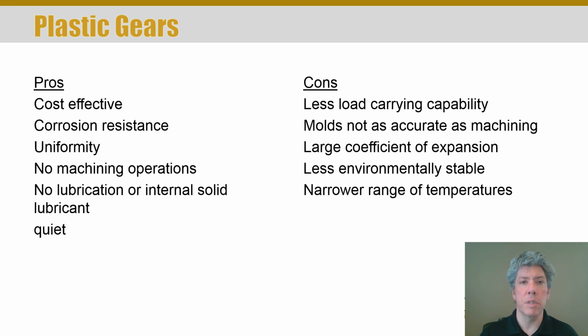It's naturally corrosion resistant to usual things like salt water, etc. But one thing you need to be aware of is something called chemical compatibility. I probably should include a chemical compatibility chart in my lecture at this point, but I didn't think of that till now. So pause the video and go look up a chemical compatibility chart. And what you'll find is that some plastics are impervious to some things and then very sensitive to others. So most of these charts will give you a sort of a compatibility rating between the particular chemical and the material in question. And typically it's plastic materials.